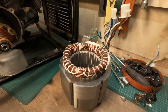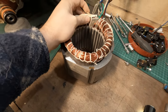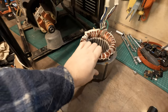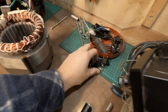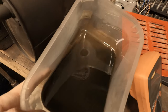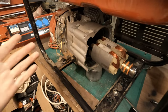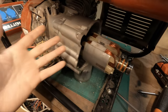So the brushes broke, grounded this out, and caused damage to the windings, which in turn then blew the regulator, which means this generator unit is junk. Something like this would be at least £30 to £50, maybe more - could be £100. Replacing the windings is just not feasible. This machine cost me £50, I spent about £5 on the regulator, and I picked up two sets of brushes for only £4 or £5. The engine itself is a good engine, but the stupid adapter plate they've got here - it's just not usable unless you're going to use it with this exact same generator.